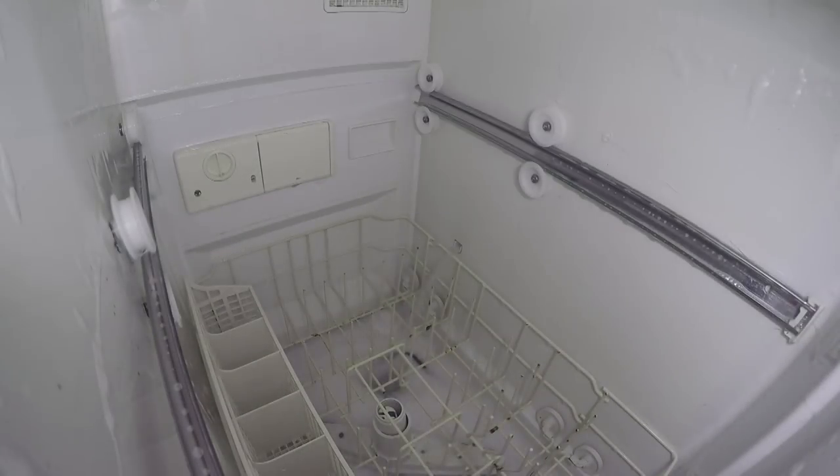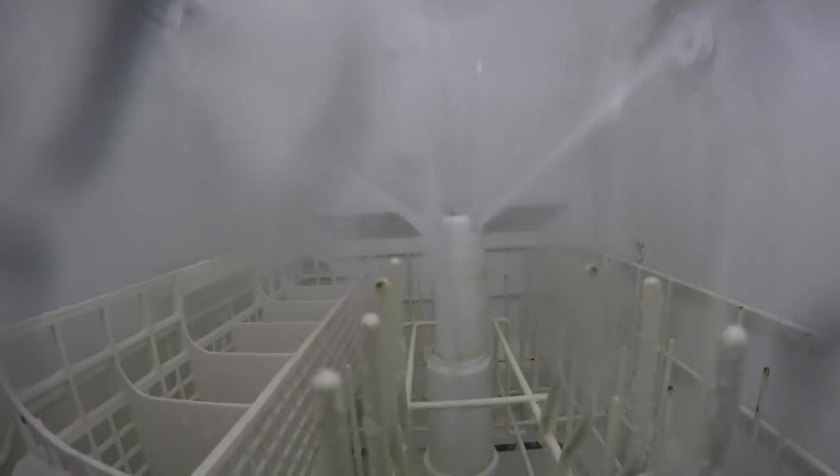It looks like the pre-wash is toning down — so this is drained, empty. After that bottom tub has refilled again and they've reheated it, you'll see that main soap door open. There it goes — the door is open. So after that main wash, you'll hear it discharge. Now the water comes on again — it's clean water going to rinse those dishes off. Some dishwashers actually dump it and then do it one more time, filling it up for a second rinse.